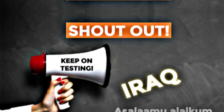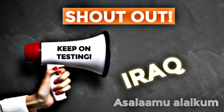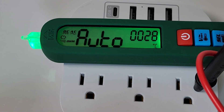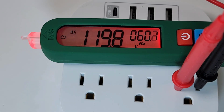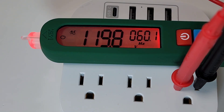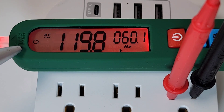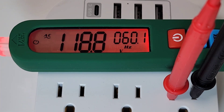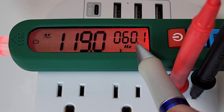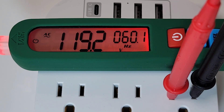This week's shout-out goes to Iraq — As-salamu alaikum, thanks for watching. Let's try out that auto mode for AC volts: 109.8 volts AC. Another cool feature is the fact that we have a nice orange alert just letting us know we're now in the high-voltage arena. We also get our frequency here — 60 Hz — coming up automatically with that big dual display. That is a pretty nice overall look. Only caveat is this is not true RMS, but for home use it really shouldn't make a difference.